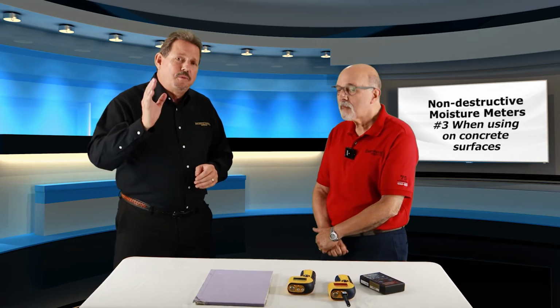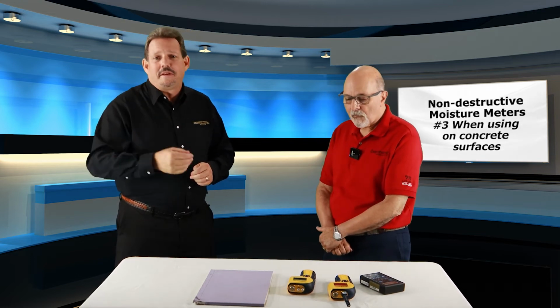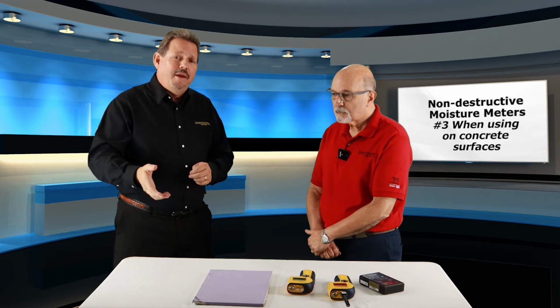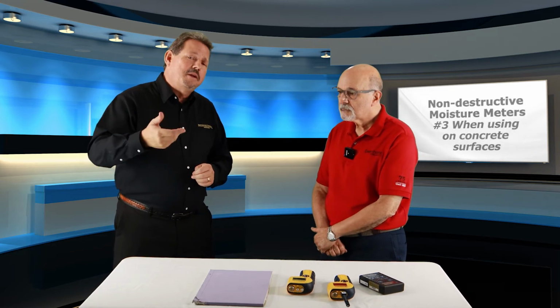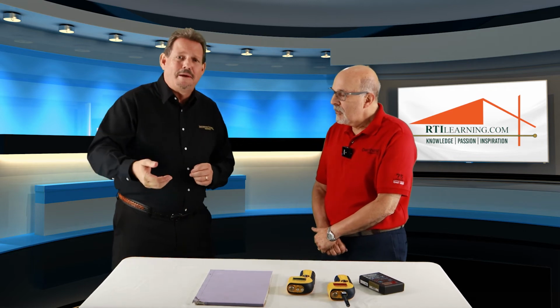So obviously what you need to do is learn your meter, learn its limitations like I always talk about, and make sure that when you're testing, you've done enough research so that when you're coming up with the numbers and you're going to write them down and present them to people, they're good, clean, accurate numbers. That's what we're looking for in the industry. And again, remember, it is a comparative standard, not an actual moisture content when it comes down to it on concrete itself.